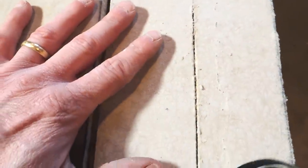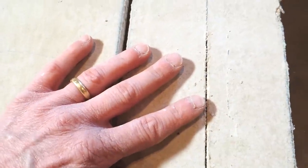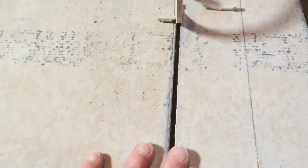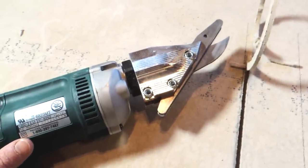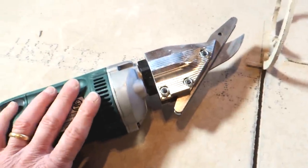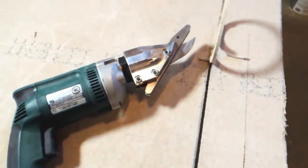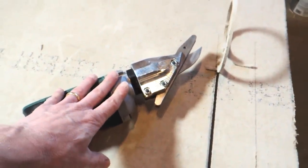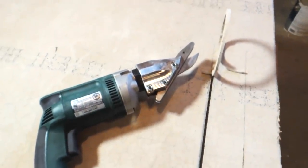So these are my two go-to methods. If you're a homeowner with just one job to do, probably just grab your jigsaw if you already own one — pick up a handful of blades, you're going to go through a bunch of them, but it'll get the job done. If you're a pro or have a lot to do, the Snapper Shear definitely gets the job done — a pro would buy one, a homeowner would probably rent one. Those are the best two ways to cut cement backer board. If you're using brands other than Hardy Backer it may be a little more troublesome, but for Hardy Backer, that's definitely the way to go.